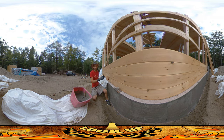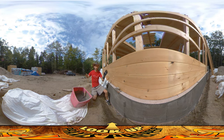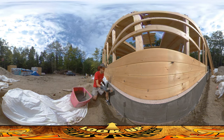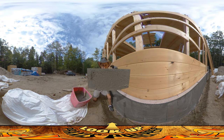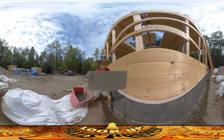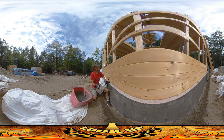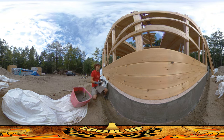I had scrap plastic that had been around wood and lumber and I kept it all moist yesterday. I've already done this section with the second pass today and I'm covering it back up because the sun is already out this morning — I don't want my second pass to be drying out prematurely. I wanted to show you what I'm doing for the second pass. It's a little rough because I did it with the rough tooth part of this tool — I'm not sure what it's called, but this is the tool I'm primarily using. The last pass I did rough, and now I'm going to do a nice smooth finish pass.